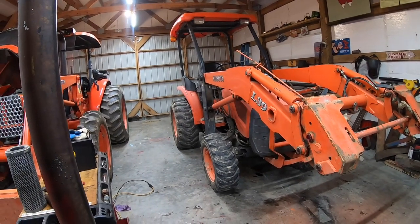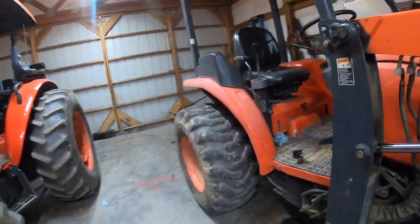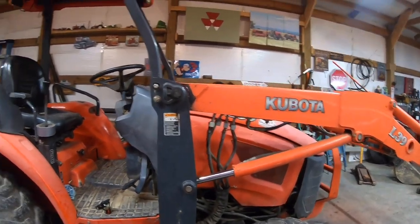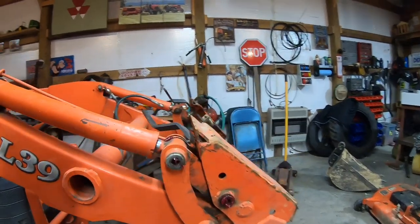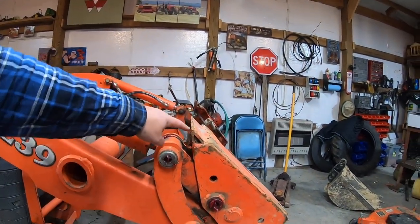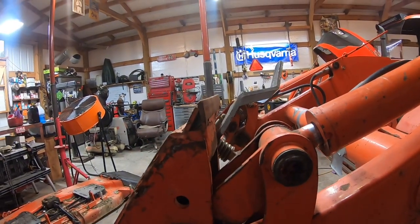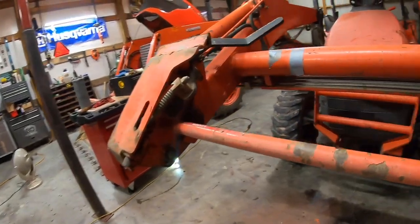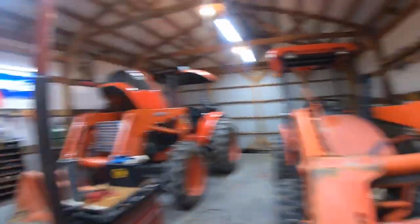We have changed the front gear oil, changed the hydraulic oil and hydraulic filters, changed the fuel filter, changed the oil filter, the air filter, and greased it. Now on to our next project, which will be a different video. This skid steer plate is twisted — this one here is right but look at the gap in that one. I think this rod in here has twisted somehow. So that'll be our next video, trying to get that fixed. If y'all will please like, subscribe, comment — thanks for watching. We'll catch you on the next one.